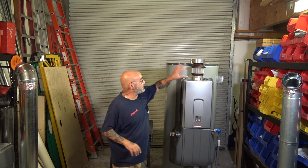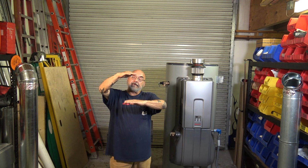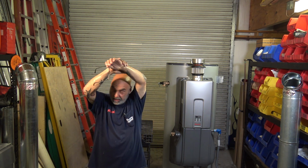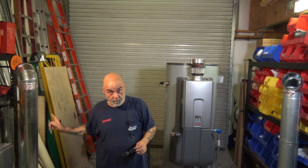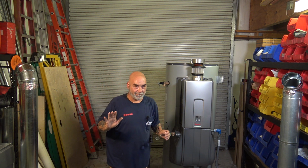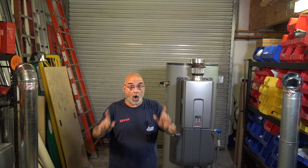So you would have this and then put it into the chimney, have at least a 6-inch drop leg, and that's why when I'm going to show you what I'm going to make, a lot of times with the B vent, you're going to find a T. T's are not good on a flue pipe. They're good for water, they're good for gas, they're not good for flue pipe. So in all cases that you can, try to get a Y fitting in.